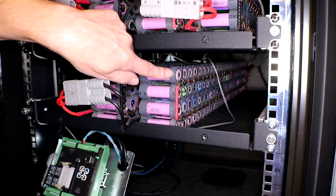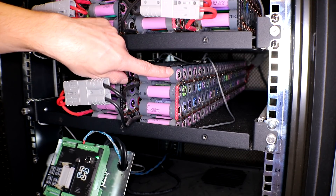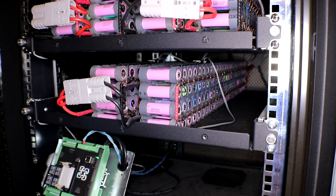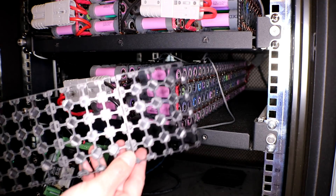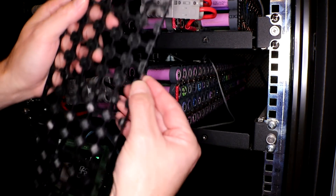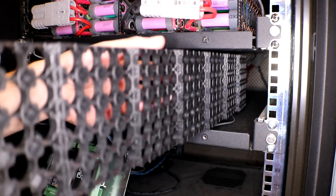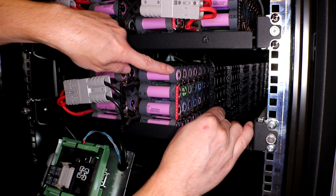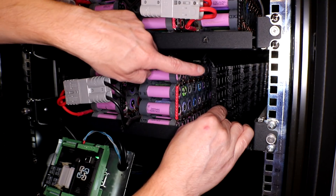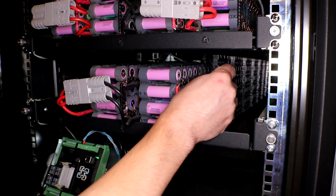I made over 1400 of these cell holders — just the rings — for about 60 bucks, and at the time it would have cost a few hundred dollars for the black cell holders. Now things are much cheaper, so I'm going to be doing the black cell holders. I got a whole bunch of these from Keith — these are the four by fives — and it looks like if I do eight in a row, five wide, I can stuff that many all the way back. It's almost the same size as my holders I have now, but instead of 100P I can make this 160P — that's how many more cells I can get in the same amount of space.